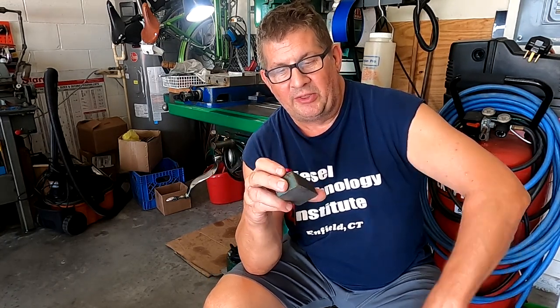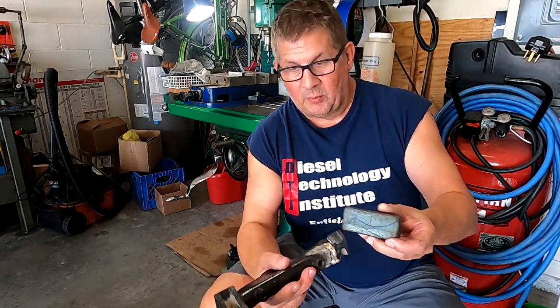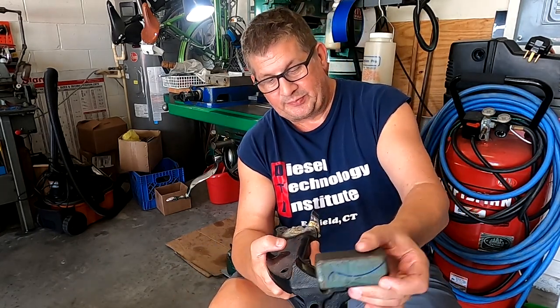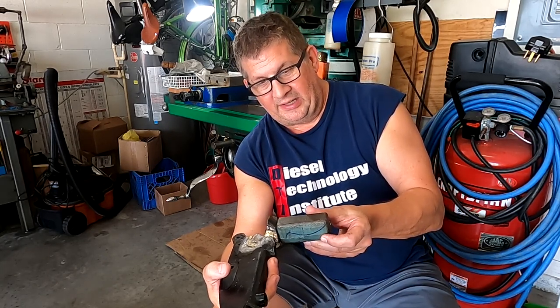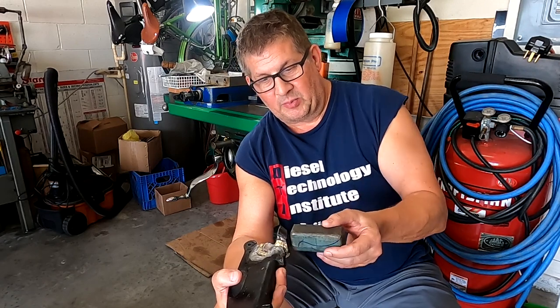So I went over and I got this block of cast iron. I chopped this section off here. I cut it the proper width. And what I need to do is put a radius in here. Once I have a radius in there, I can just braze it on like that and have an opposing support